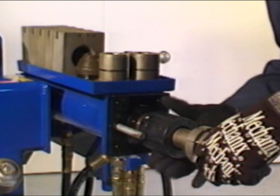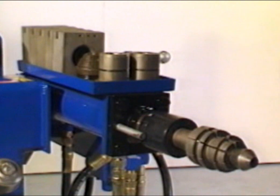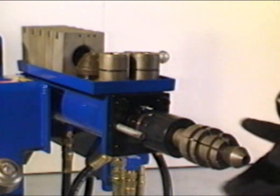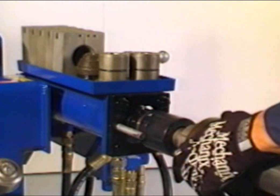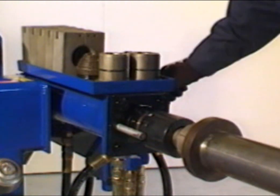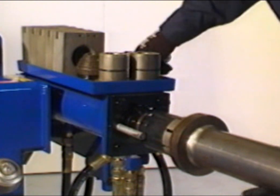Adjust the buttress canister until the grooved line on the canister is lined up with the grooved line on the pointer. Then center the X symbol on top. Place the proper size limit ring over the end of the tubing. Position the tubing over the arbor and segment expander until the tubing and limit ring meets the shoulder.